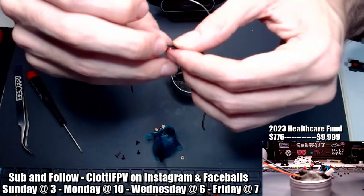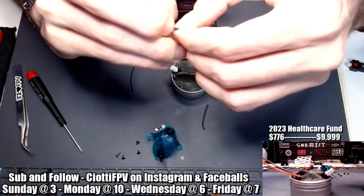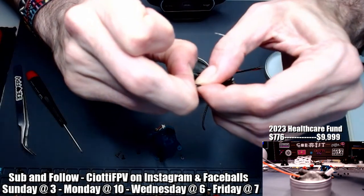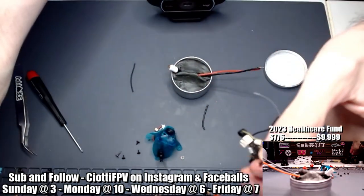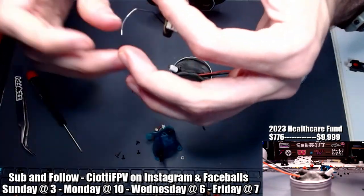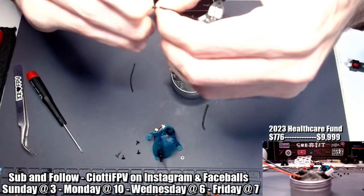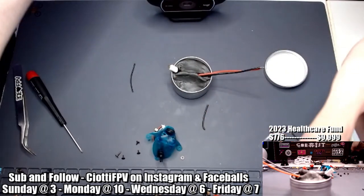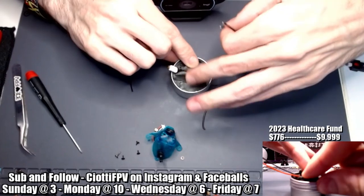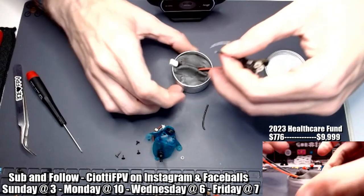So ground was by the grommet, so ground is going to be on the outside. And then I believe on BT 2.0, round is ground. I believe the round part of the BT 2.0 connector, that pin on the round side, is the ground. And we can confirm that in a second here with this other BT 2.0 lead that I have sitting here. And yeah, sure enough, ground, the black wire, is on the round side.